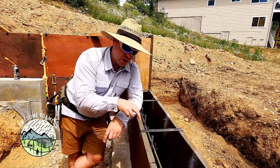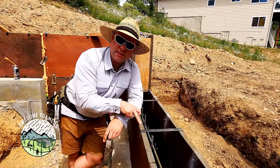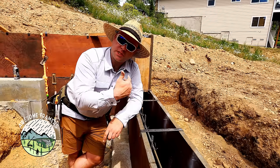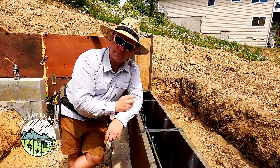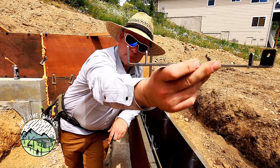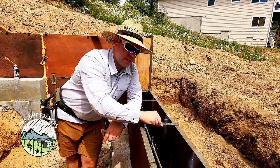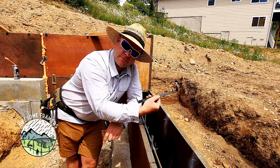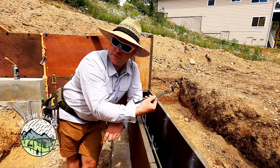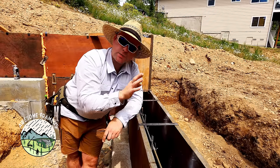A lot of questions on our forming system — this is very common here in the Pacific Northwest. It relies on two-foot by eight-foot MDO forms: they're two-foot by eight-foot long, inch-and-an-eighth thick, a plywood product, very stiff. We stack them in two-foot increments either horizontally or vertically. What holds them to the footing are spreader cleats — the panel sits right in there. We space them about every 16 inches typically, and every 12 inches once we get to six foot and above, and at all panel seams.